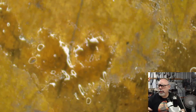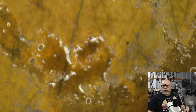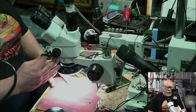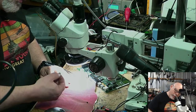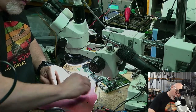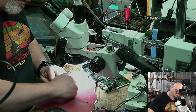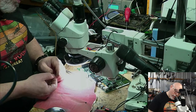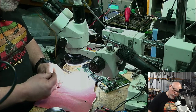Nice. That's nice. Okay. Might just hit that with a bit of sandpaper. The edge of those look pretty nasty. Always keep sandpaper. Gotta have sandpaper in the workshop, don't you? Ooh, this chip is hot. So, just gonna take a little bit of that grungy coating off the outside of those chips without taking too much away, and without damaging the pins or anything like that. Something I've managed to avoid.